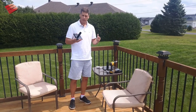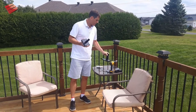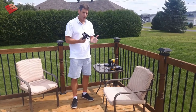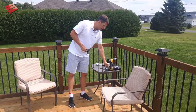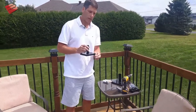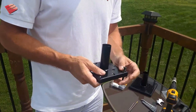Now if you're not familiar with the Titan Post Anchor, this is the 4x4, this is the 6x6, and this particular job just used the 4x4. What you're going to get in your kit is a post anchor — hot zinc galvanized and powder coated — along with some lag screws and some deck screws, which are flat head screws that fit into precisely countered bore holes, so you get a really nice finish.